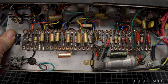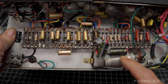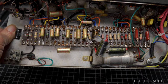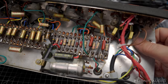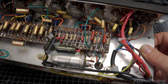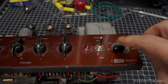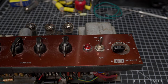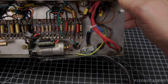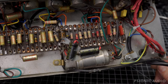I can see that almost all the resistors in here have been changed out, some better than others. This probably all works, it's just not a very good way to do things and it's not very lovely. It's got an added fuse holder here, which is a tight squeeze. It's got some caps on the non-original power switch — that power switch is infinite overkill for the current of this amp. We're going to leave the voltage selector switch cosmetically but hardwire it to 115. I'll probably recap it all because all the previous recapping was done so ugly. Overall, it's in pretty good shape though, and I don't think this is going to be that problematic.